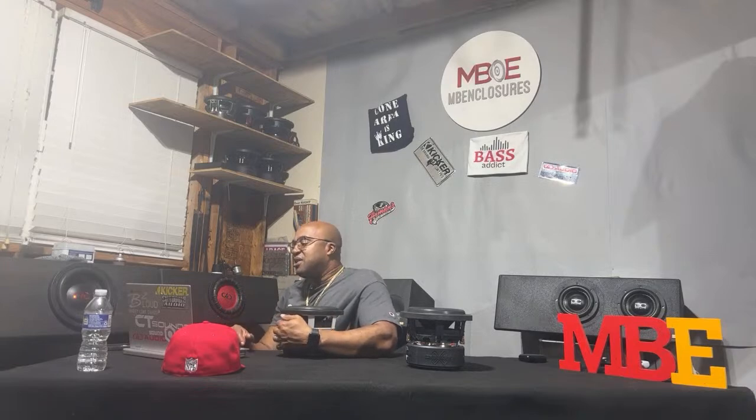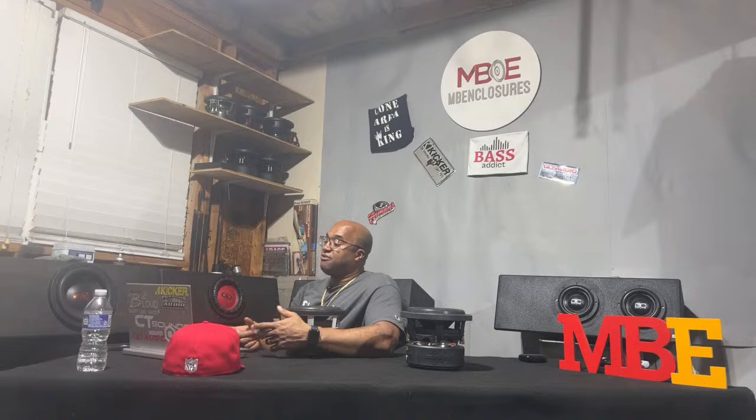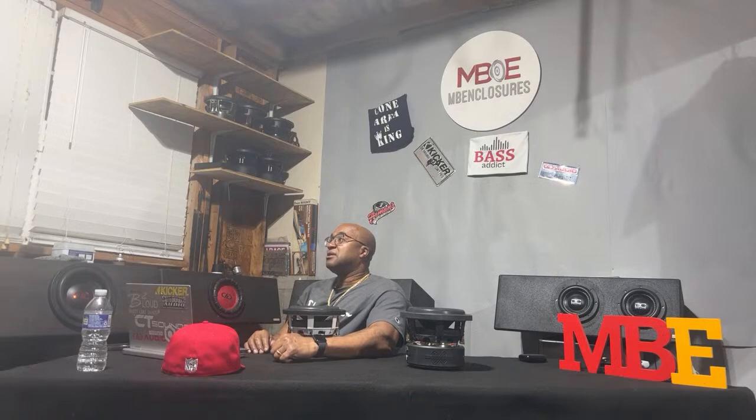Well, I don't know. You got a Neo 21, and so you got a Neo motor sub. It's gonna play substantially low below tuning because of the force of the sub. So if I tune to 38, will it still play 32? You still gonna play 32, lesser in output than 38, depending on your cab resonance. But yeah, tune 38, you'll be fine.